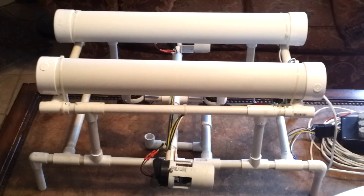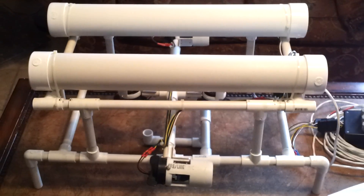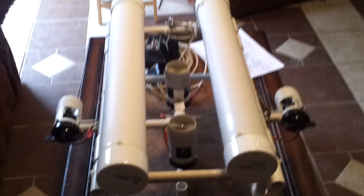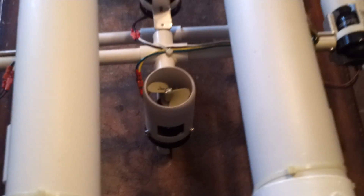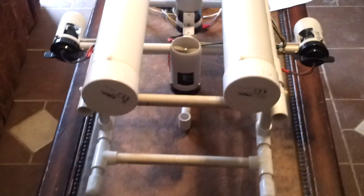There's still work left to do. You'll need to fill the tubes with water if the robot is too light — if there's too much air in the tubes it won't dive — or add buoyancy by adding another tube or some foam. Two tubes were chosen to keep the robot stable, one on each side, but you'll need to seal them and put some kind of valve in to let water in or out of both. If you have time, you might add an equalization tube across the bottom connecting both sides so water can transfer from one to the other, making it easier to manage both tubes at once.